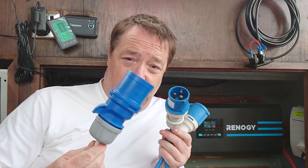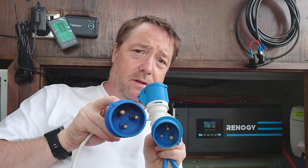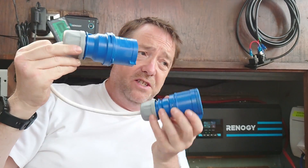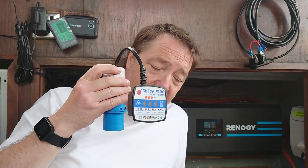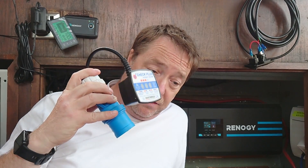These are rated for 16 amps or 3,680 watts. If you've got a massive superyacht you might find you have a slightly larger connector, the 32 amp. So I keep a little adapter that's a 32 amp to 16 in case I end up on a superyacht berth. I also carry the all-important mains tester, which is very useful for checking that you've actually got power and that it's the socket that's the fault and not something on your boat.